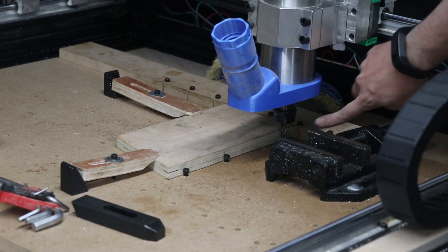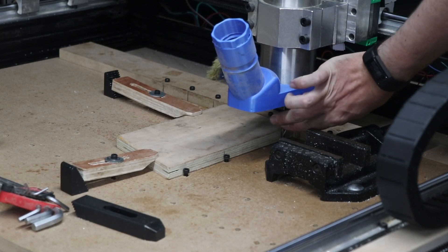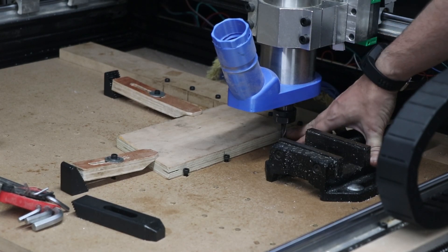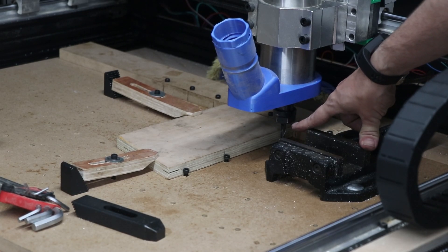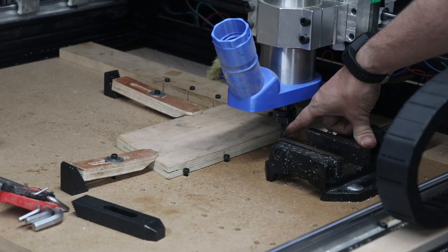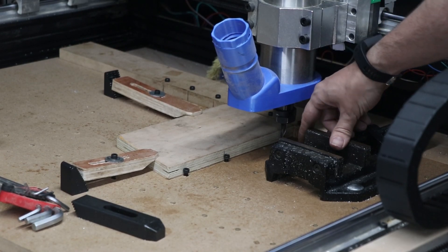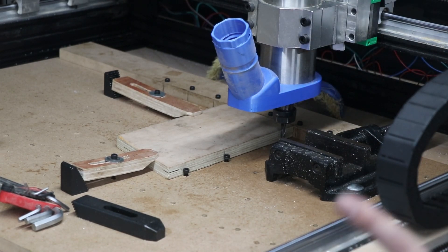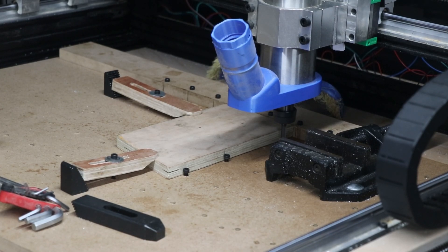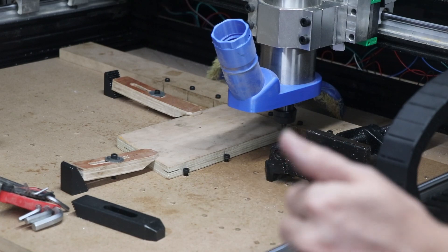You can't see terribly well from that angle, but I've got the same ripping cutter bit in here. I've set it down on the deck. I'm just going to do a 5cm jog that way, 5cm this way, 5cm this way. That could be problematic because it will, if it's successful, cut this block out. But that's the test, as was done originally. So I need to set the spindle going. We're coming up to 14,000 RPM. Moment of truth. Let's do it.